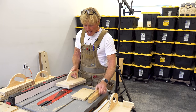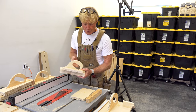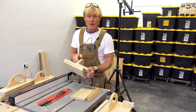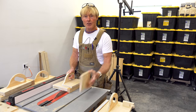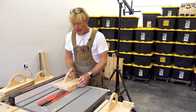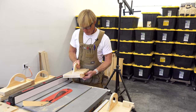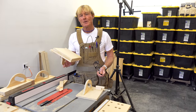The other thing I did was the back section — I cut a window in it to see where the material touches the stop for the thick or the thin shim. And then I shortened it on the top side again just so that I could see the material beginning and end. A little easier to make — I didn't have to make that two millimeter rip — and it works better because it holds it all the way through. So let me show you how it works. Thanks for sticking around to the end. I hope you enjoyed the bonus.